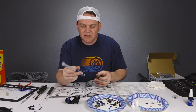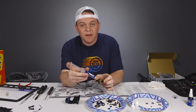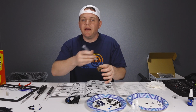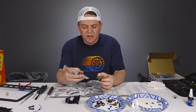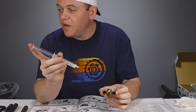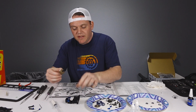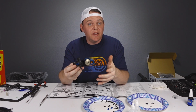So to apply this stuff, I'm just going to put it on the main diff gear and I'm going to run it diagonally across a section. And then once the gears inside the gearbox have been spinning and moving a lot, the grease just tends to be distributed amongst all the gears in the gearbox. So let's try it. So something like that. That's just a nice cross section, so it hits the entire width of our gears here. And as we start running, like I said, it'll just distribute around. So here the gearbox is completely done and ready to be installed on the chassis.